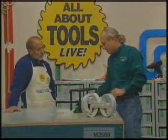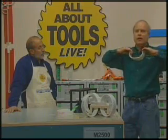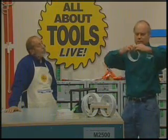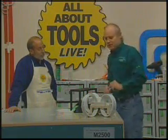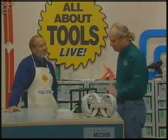A lot of people think that standard PVC, this is a similar piece of standard PVC, you pull it and it loses its memory. It does not come together. Whereas the Danny clamps have memory manufactured in, so they always come back. And you can always snap them. Most of the fabricators I talk to say they love to hear this sound at the end of the day because they know the clamps are coming off the top.